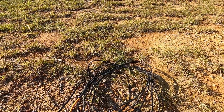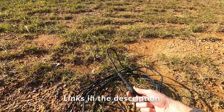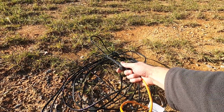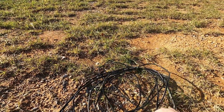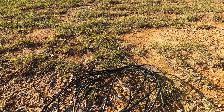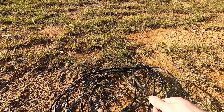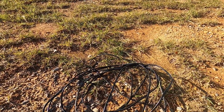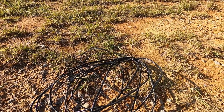Now this is the heated cable. It's the same thing, it has a sensor to detect if it needs to kick on or not, depending on how cold it is. Plug that in. You can either wrap it around your sewer hose. We just ran ours underneath, used electrical tape, and then put some insulation under it, and it worked really well.